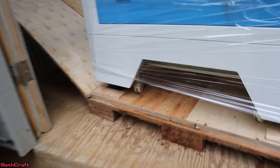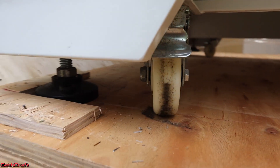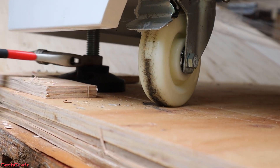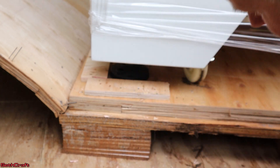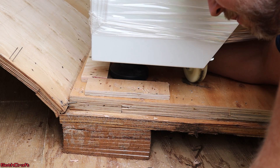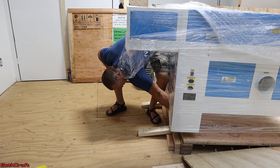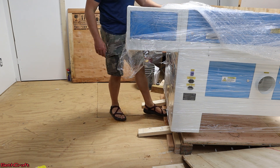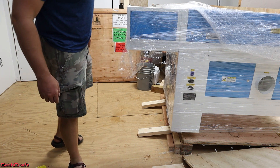There are both wheels and feet here on the Nova 35. It's a little hard to see under there because it's so dark. You're able to use a wrench to undo these bolts on the lower side to lift this up off the pallet. Once it's loose enough you can use your hand to pull this up. I'm going to unlock the wheels — I've got the last one. I'm going to use this little ramp that I made. It's either going to go super smooth or this is about to be a disaster.